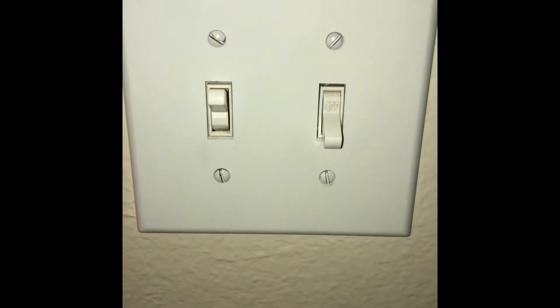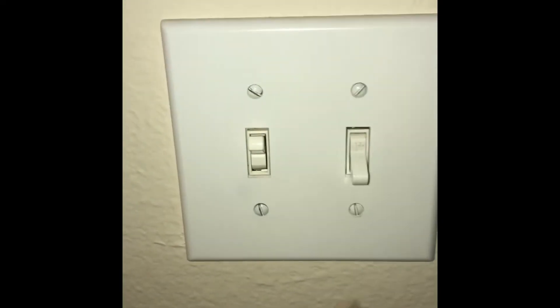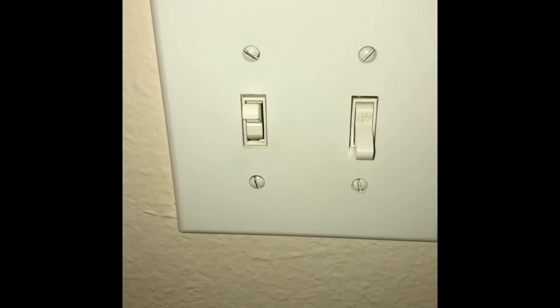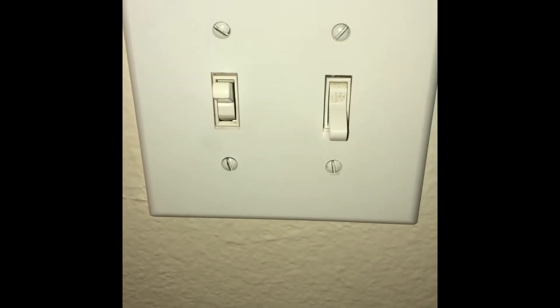Head to the attic — I want you to look at the light switch. If you've had a serviceman over, maybe working on the cable or something, let's make sure they didn't flip off the power to your furnace by mistake. If your thermostat is blank with nothing on it, this is a good place to start.